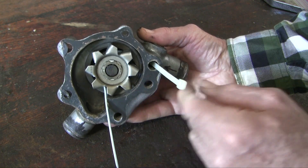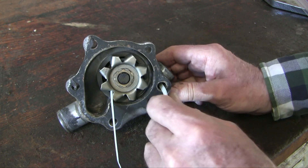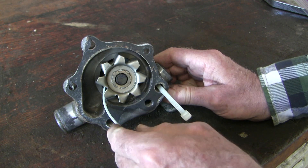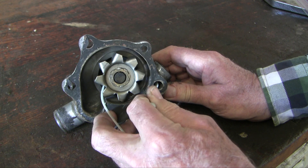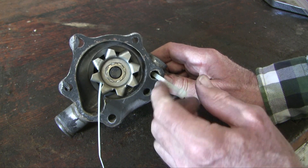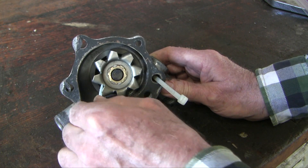But what's this hole right here? There's a hole that's contiguous with the intake of the pump — it's a little bypass hole. This is the bypass track that allows you to bypass the heat exchanger when the engine is first warming up, when it's really cold. The number one goal of the cooling system is to cool the engine, but the first priority is to allow the engine to warm up very quickly, because most engine wear happens right at the very beginning, when it's cold and the oil is thick and sludgy. When the engine is cold, instead of fluid going to the heat exchanger, the coolant goes immediately back into the engine through this bypass track, allowing the engine to warm up very quickly.